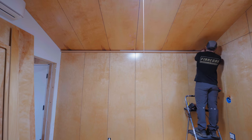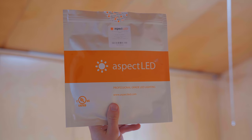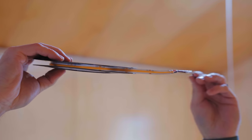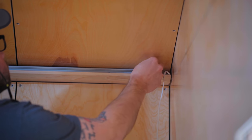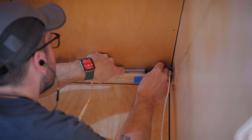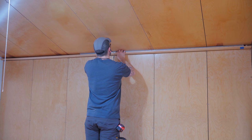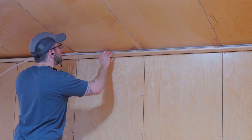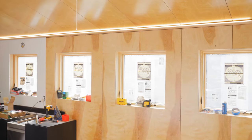With one half of the master bedroom worked out I could move on to the rest of the house. Rather than the little square elements like typical LED strips have, these are one continuous linear strip of light which looks so much better in this kind of application. I had run low voltage wire through the walls earlier in the project, which allowed me to connect the second strip to the first on the opposite side of the room so both strips could run off one power supply. I used a mini low voltage junction box connector to securely connect the wires and tucked everything back in the trim to hide the wiring. I repeated the process in the living and kitchen space and the guest bedroom and then called the LED strip installation done.